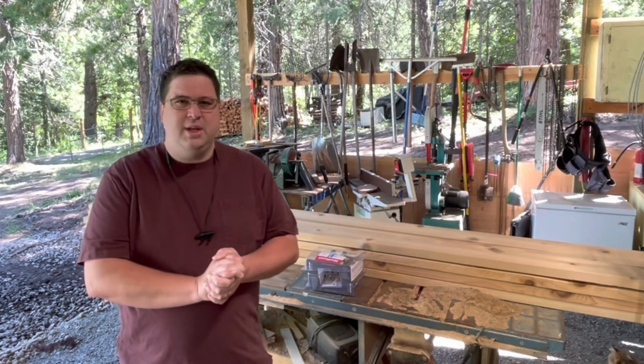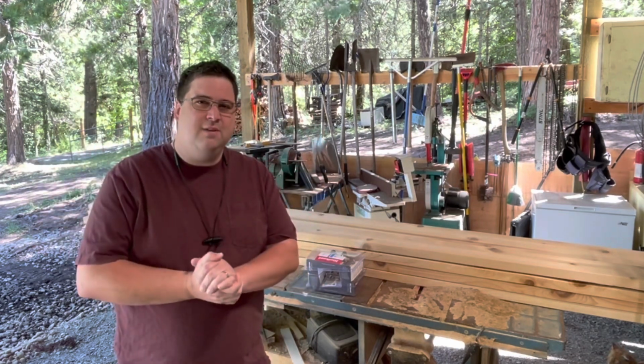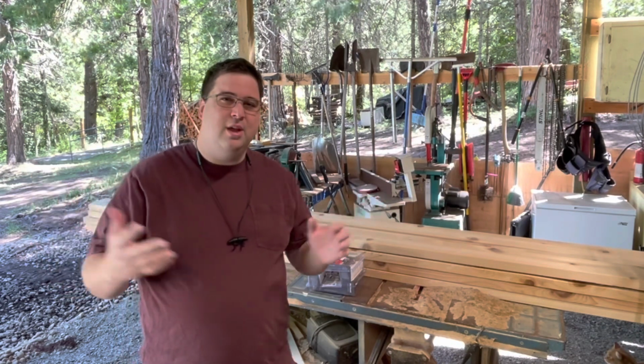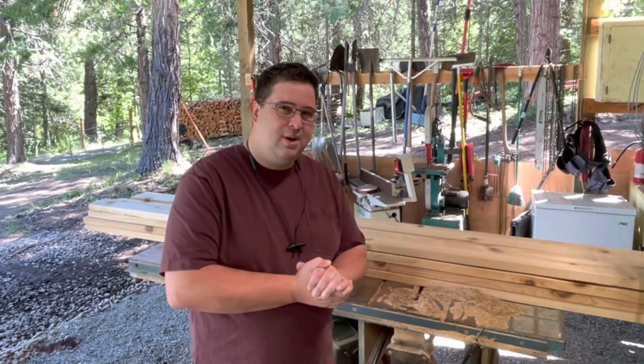These are simply going to be two panel doors. We're going to start by cutting the length of our side rails and then our cross rails, and then we'll fill in the middle with the remaining measurements for our panels. We're going to do a raised panel like we've done on our other doors. All right, let's get cracking.